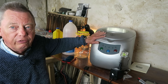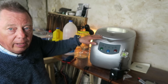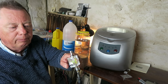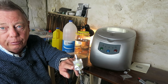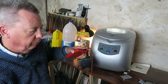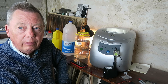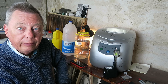It's recommended to keep the tube running somewhere around 15 degrees, and that's the temperature I'm going to aim for. To aid me in that task I've purchased a new pump, and I thought it would be a good idea to put on one of these flow indicators. It doesn't actually measure anything accurately, but it tells me the water is flowing and, perhaps more importantly, has a temperature sensor in it. This runs off 5 volts, which I can pull easily from my K40 — I've already got a tap off to power the crosshair LEDs. That then is a walkthrough of all the bits and pieces I'm going to be using.